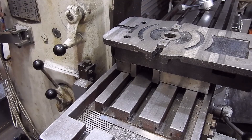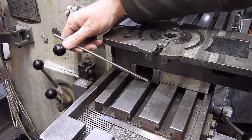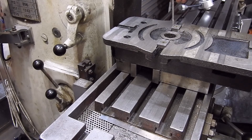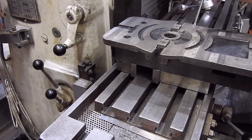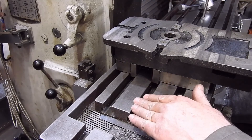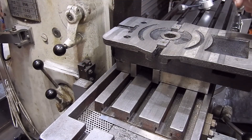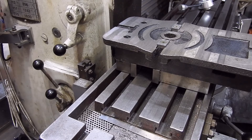This is the trick that helps you get your alignment right. These vises have protruding jaws, so what you can do is come down and clamp on the top of your T-slots like so. Then it's simply a matter of running your cutter along — and that's why we wanted a bit of clearance at the bottom of the vise, so you don't have to worry about cutting grooves in your vise. You can then machine that off, do your careful measuring and machine the other side, so you get a nice snug fit. Because you've got these clamped to the vise and the vise is clamped to the T-slot, these are going to be lined up with the T-slots. That's the trick and that's how you get these keys in good alignment.